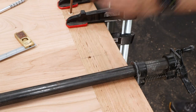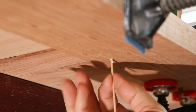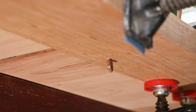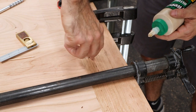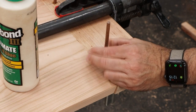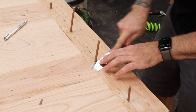You can see we're poked through about a half inch on the bottom — we'll just let that dry. For the outer holes, we want to lock the peg to the breadboard while not gluing it to the table's tenon. So I'll add glue to the hole on the underside, and then after the peg is in place, add some glue at the top and hammer it in just a little bit more. That technique is applied for all of the slotted pegs. All the pegs are then trimmed flush and sanded.